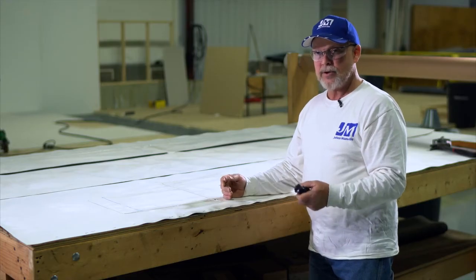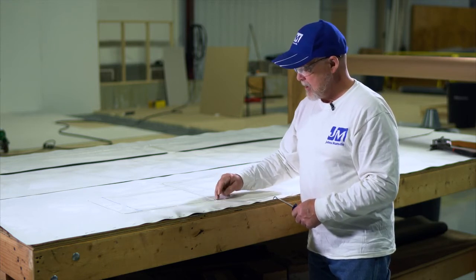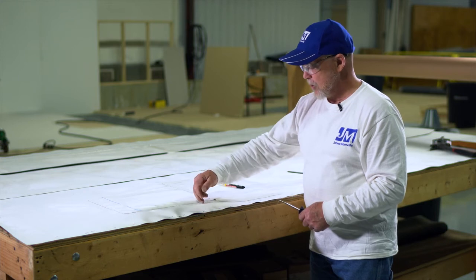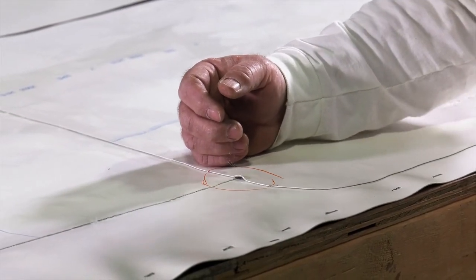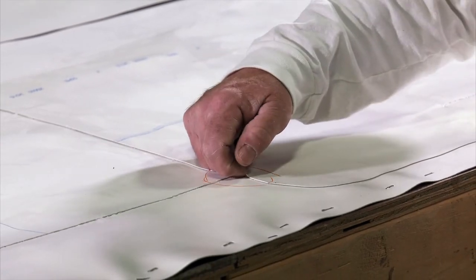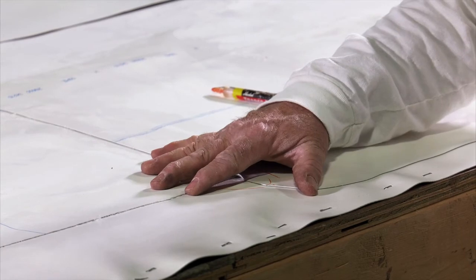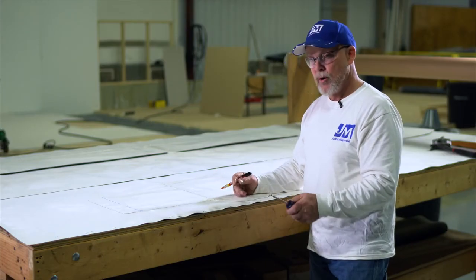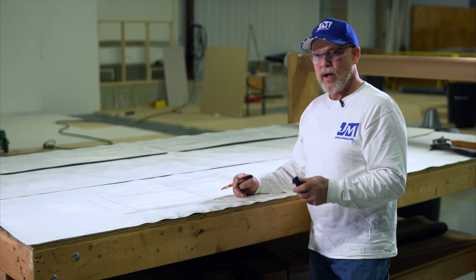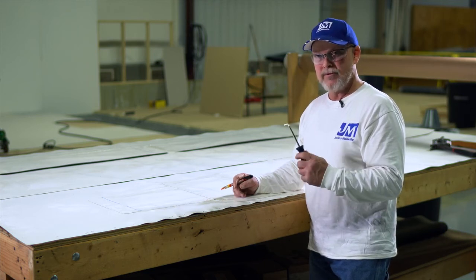If you leave it go for a day or two, or till the end of the job, the dirt or rain or water gets into these voids and contaminates them. There's no way to clean that debris or dirt out of that small opening, and you have to patch the area — you don't have any choice. Make sure you do it the same day. Probe all your work. Remember, no hand weld is completed until you probe and finish probing.